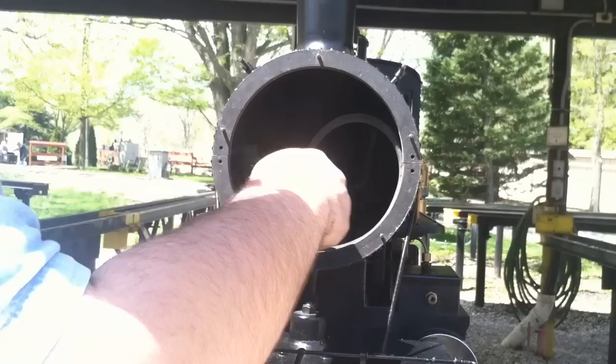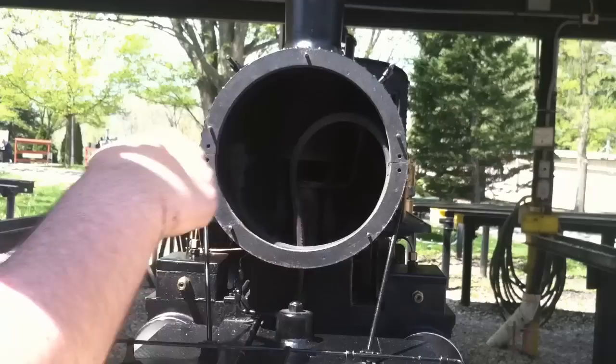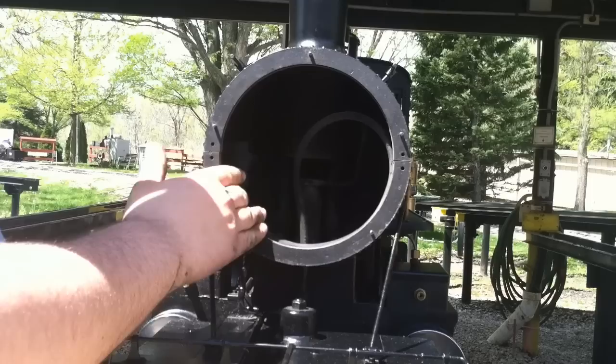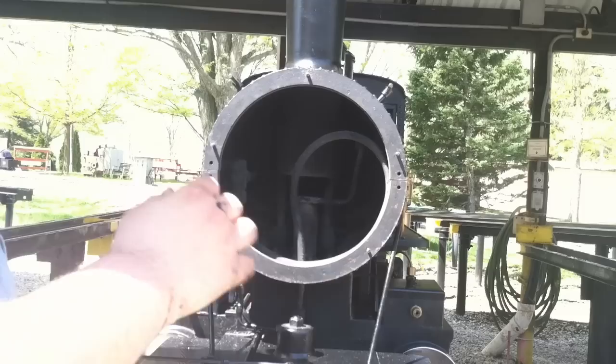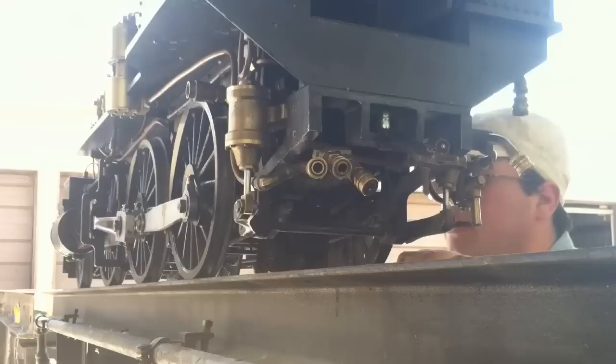These two lines way in the back are the steam delivery lines from the boiler after the throttle, and they go straight down to each cylinder. Far in the back is where the individual flues are — this locomotive has 24 copper flues and they must be cleaned every day before operation. We're going to vacuum out all this soot here from the last run to help clean the smoke box out. It's very important to keep this cleaned out, otherwise it will rain down cinders and ashes.